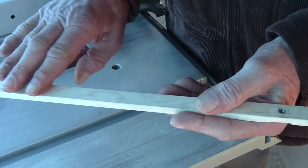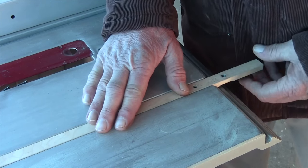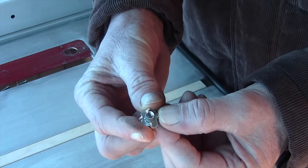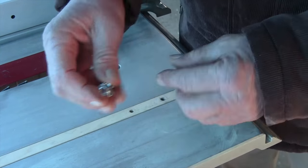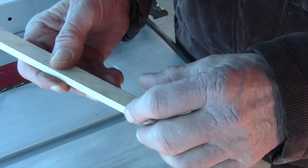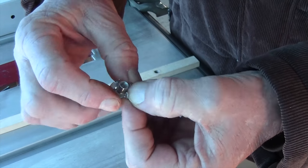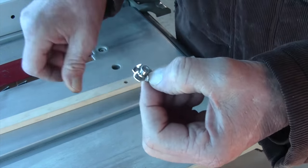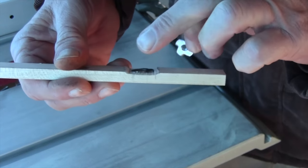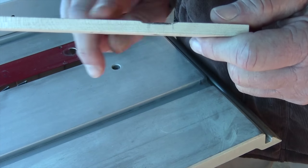Then flip it and plane the top surface down until you get it just a little lower than the table top itself. I purchased a T-nut which is a quarter by twenty by five-sixteenths — this is what that looks like. It was too wide for this piece of wood and kind of hangs over the side, so I took my grinder and ground off the two end flanges. Now I just got the two left, that's all you need. I sent this through the table saw to countersink it, then drove it in — now it sits lower than the surface, which worked great.